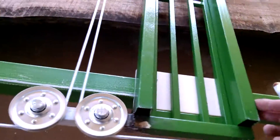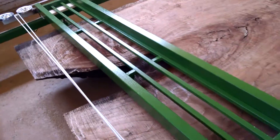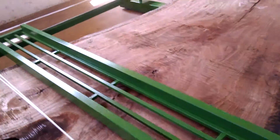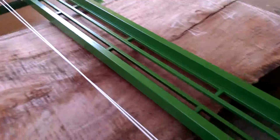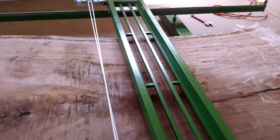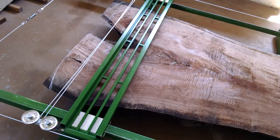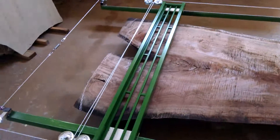That's how it works — like a drafting table. And that doesn't really do anything but make it easier, because when this thing can tip back and forth, it racks. And when it racks, it jams up. And if it jams up, it can jump the track and wreak all kinds of havoc when the router bit comes back in contact with the slab.